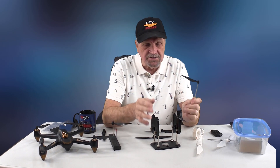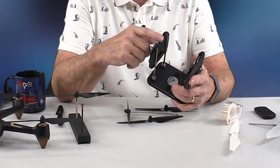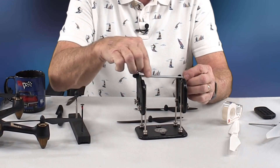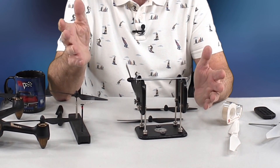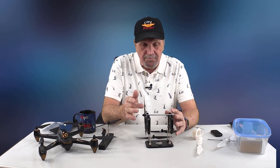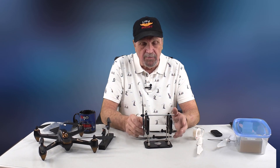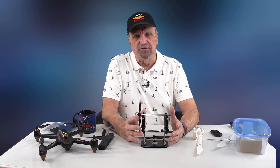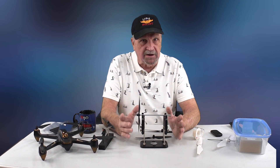This unit here has little fins that actually move extremely easily. When you put the shaft in and balance your blade, there is no friction — this thing moves as easy as that and will go for a long time. I like it because you can balance really well. One thing you need to do is make sure it's level and that both sides are at the same height. The manufacturer has a whole procedure on how to set this up and use it.